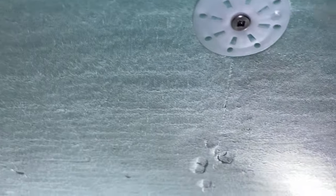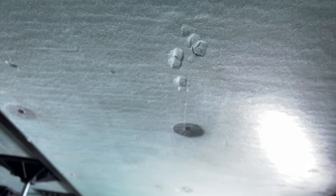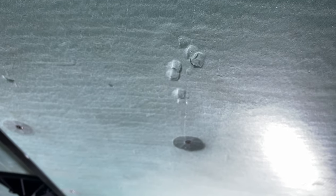That screw can go through both layers and get into the three-quarter-inch subfloor without protruding through the other side. My floor joists are on 24-inch centers, so I put the screws on 12-inch centers — three rows of screws in each cavity, 12 inches apart. That comes out to 21 screws and 21 washers per floor cavity.